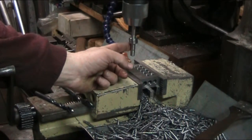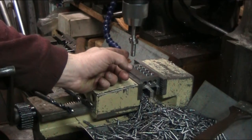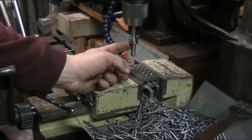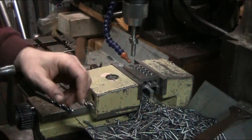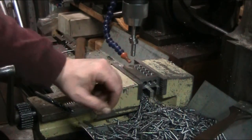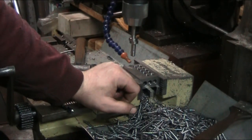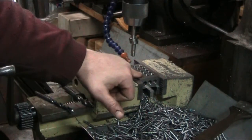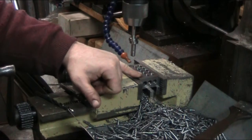This is a 10-millimeter shaft — close to 3/8 inch. On this metric Bridgeport, one rotation is 5 millimeters, roughly 200 thousandths. When I set zero on the dial using the edge finder, I just need to go in 5 millimeters — half the diameter of this 10-millimeter edge finder — so I only have to go one rotation to hit zero on the edge, then dial in 12.7 or 12.75 millimeters.